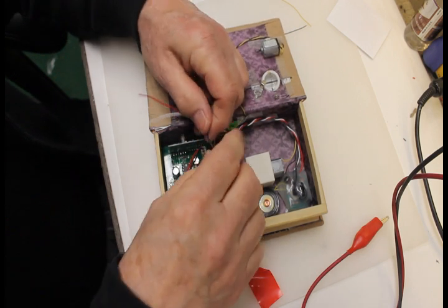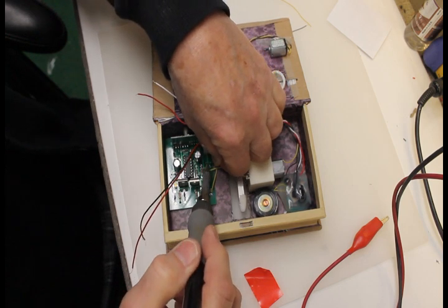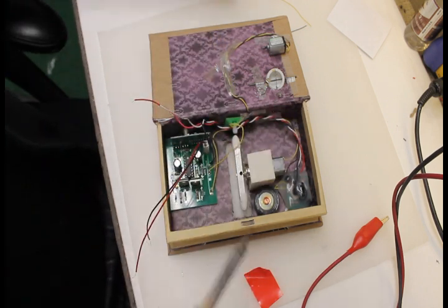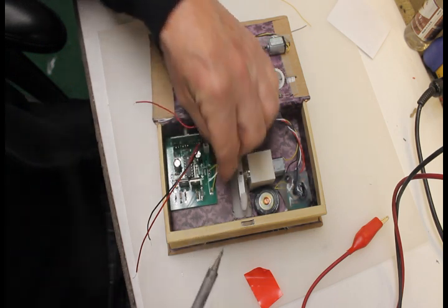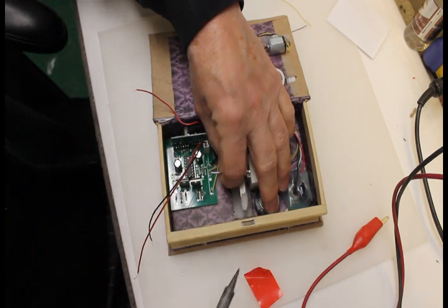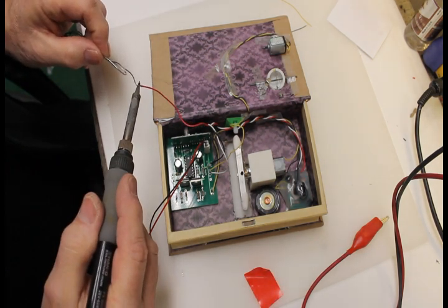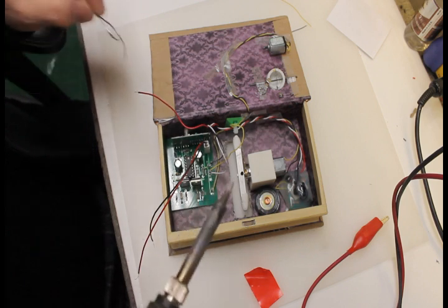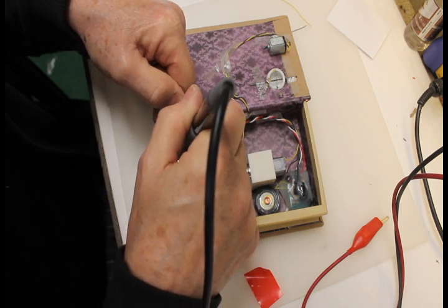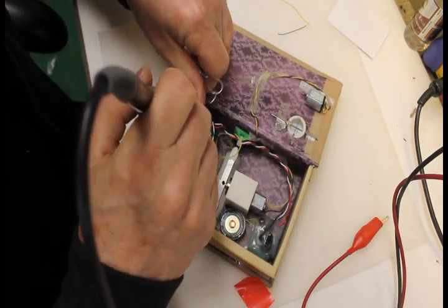These 3 wires, the black one is ground and also goes onto pad 3. The white one gets its signal from the board, so we'll solder that to the other H2 pad. And then the red lead, which is the plus to my sound module, gets soldered to pad 1. It's over in a different spot in the board, just for layout necessity.